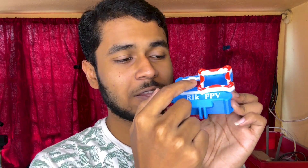First, I used my slicer to slice this model. It was printed bottom to top - the portion below was on the build plate and the different colors are on different layers. The entire body was printed with blue, then I switched to white TPU, and the final part was printed with red TPU. In the slicer, I went to the layer where the color was about to change and added a pause statement just before that layer. It paused the 3D printer at that specific layer, I changed the filament from blue to white, then resumed the print.